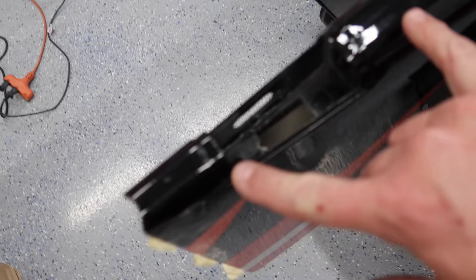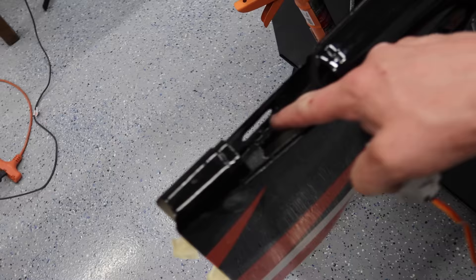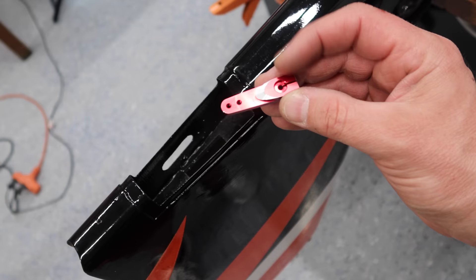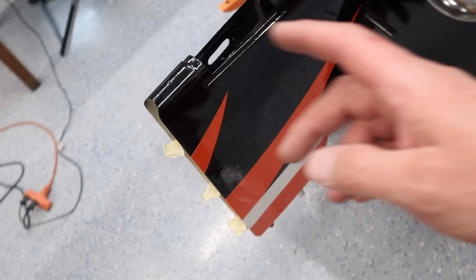We're going to start with the left boom. We needed to add a little notch in the opening for the servo to go in. The output shaft goes towards the back - this is a nice size opening. If you use the rubbers on your servos it'll bring it right into the middle of the opening; we're not using them so it brings us just to the bottom section. We're also using the MKS aluminum servo arms - they look like the right size, 1.25 or 1 inch holes - and that's what's going to be controlling this rudder servo.